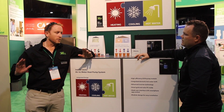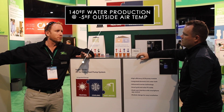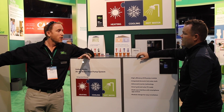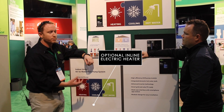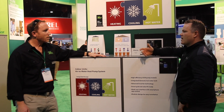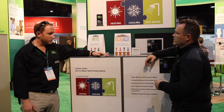Yes. Its ideal operating range — it can produce 140 degrees Fahrenheit water down to minus five degrees Fahrenheit outdoor air. There will also be, as part of the indoor package, an electrical flow-through heater that can boost the fluid temperature when you're starting to reach those temperature limits. You could also use an air handler with a gas burner, something like that — a traditional furnace like the one in my house.